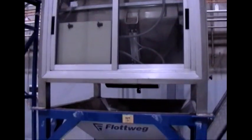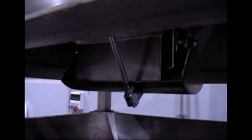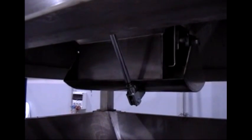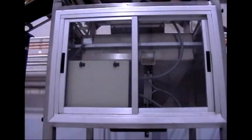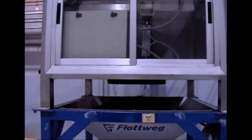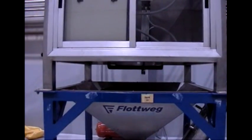There's a weighing device. Before they come down, once the weight is full, this device will then release the olives into the hopper. Once the hopper is full, the machine weighs the olives and it opens the trap door. They're closed again, the hopper fills with olives, then it opens again.